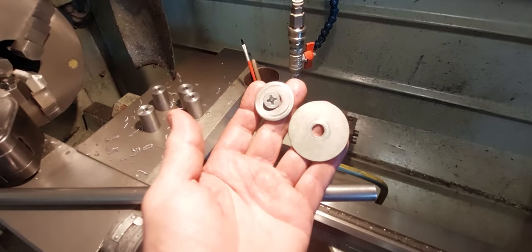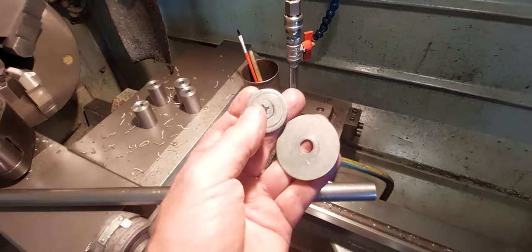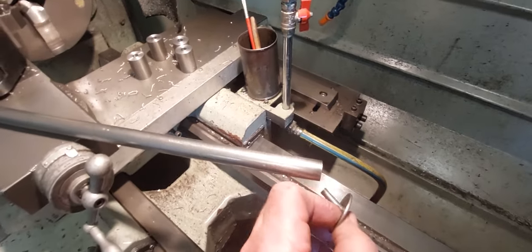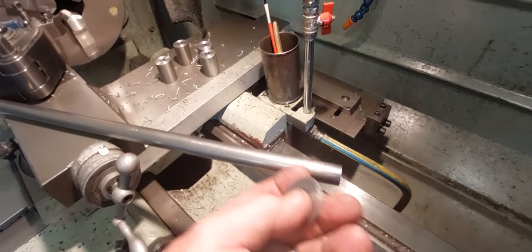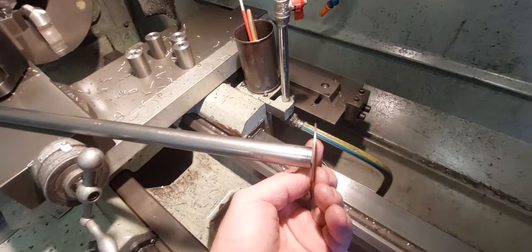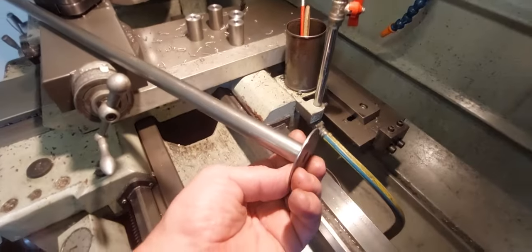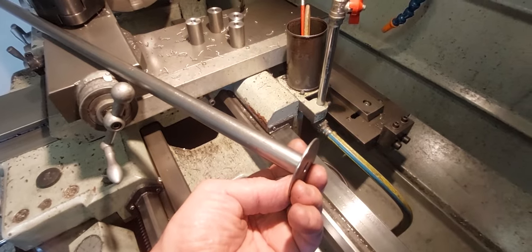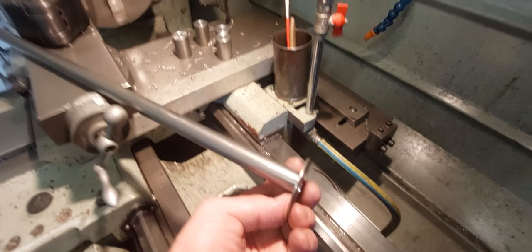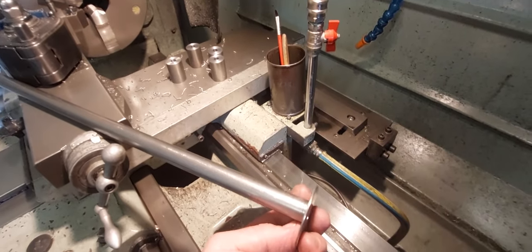Then we have two washers of varying sizes. The screw goes in and is retained with the thread. You've got a larger washer so when you have hollow bar or a larger bush you push the part up against it. I'll set it up in the machine to show you. I've already faced off one end so as not to waste too much time, then I'll put them back in, face off each one, and bring them back to measure.